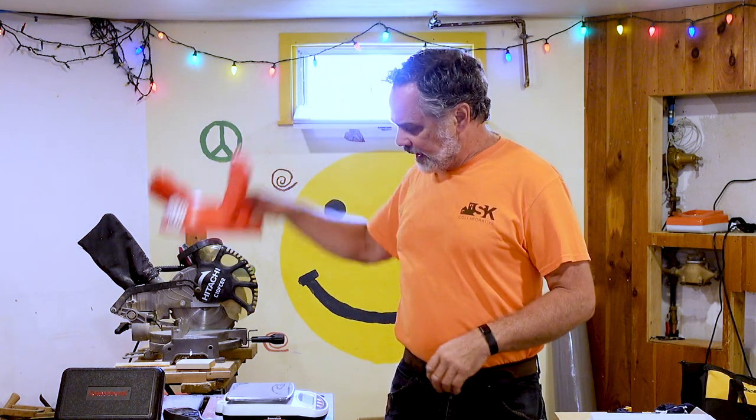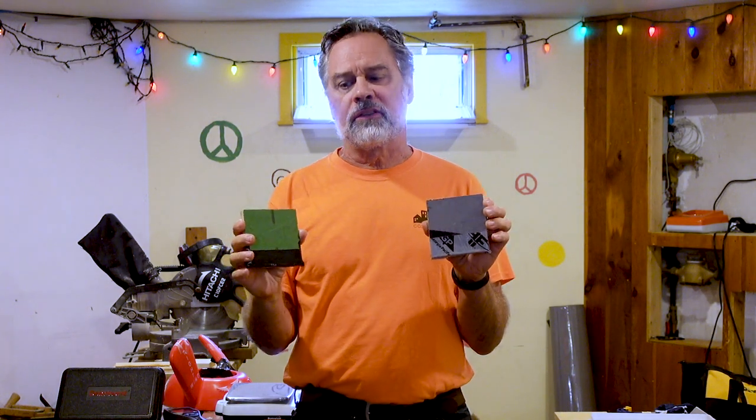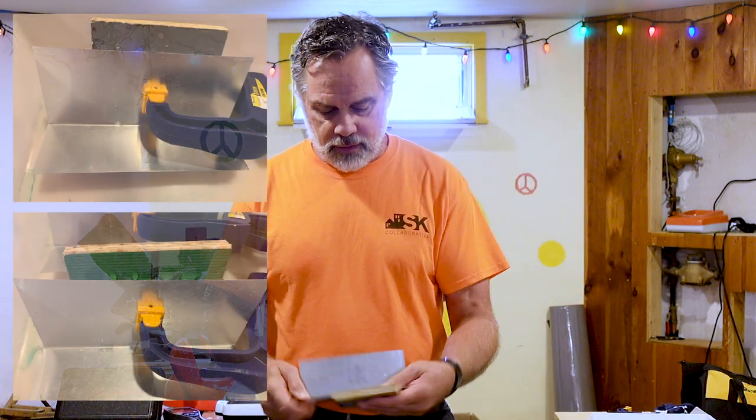Welcome back, everyone. We're here at the Wingnut Test Facility in Brattleboro, Vermont. Just a quick reminder — we are testing two types of integrated weather-resistant barrier and structural sheathing: the Huber Zip System and the Georgia-Pacific Force Field, for how they manage water held in tension between the weather-resistant barrier and a cladding when there's direct contact between the two. I've done two rounds of testing, each time placing a milliliter of water along that edge between the flashing and the weather-resistant barrier using an eyedropper, to see how water held in tension behaves at the weather-resistant barrier.